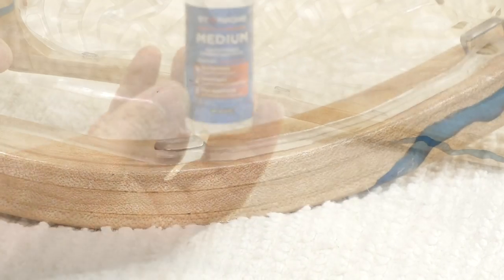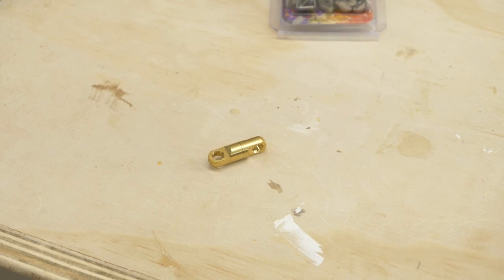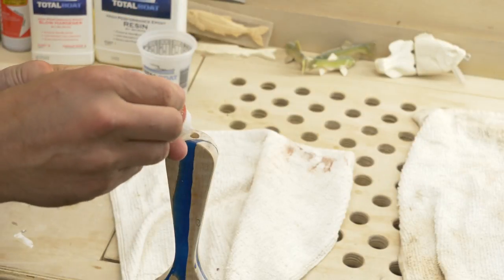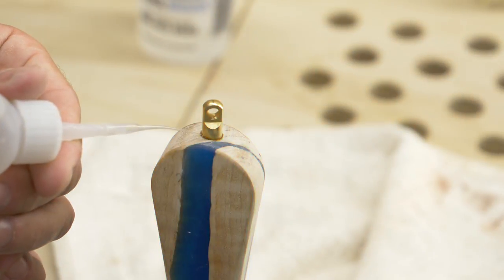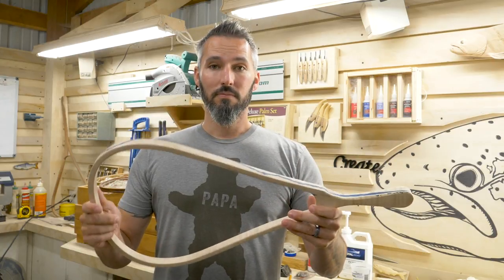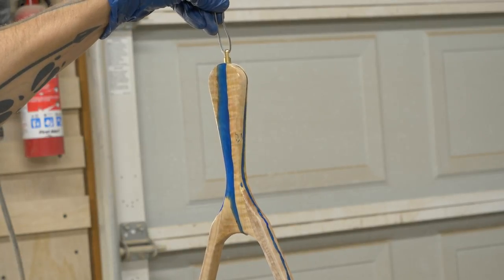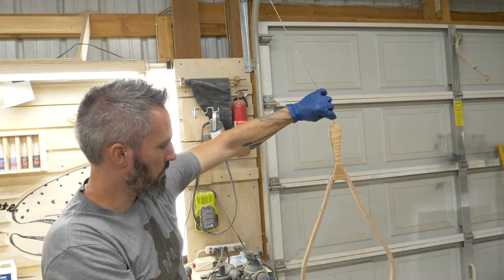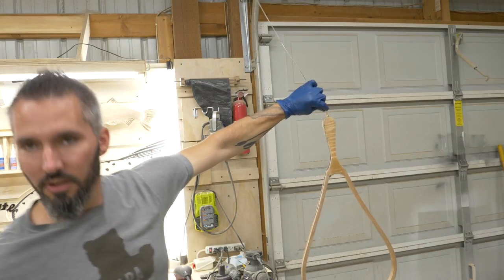I think it's going to look good. On the end, I'm drilling out for a brass connector. This will allow a lanyard to be connected to it — it pivots, so it's really easy to maneuver the net. With that installed, it's on to finish. Quick breakdown on the finishing process: I have a rattle can clear gloss that's really heavy duty. I'm going to spray a light coat initially, do a quick sand with 1200 grit, then move on to heavier coats. I'll hang it up between sets, let it set completely, sand again, and repeat.